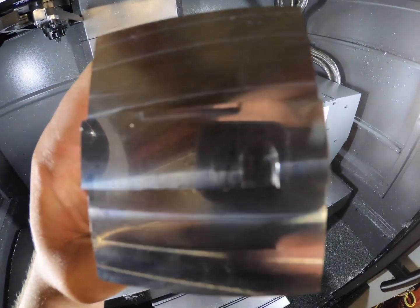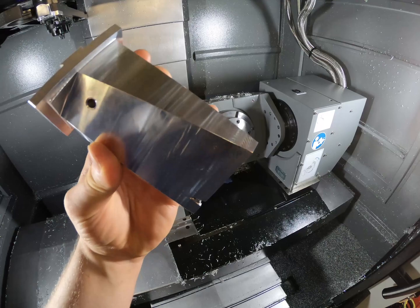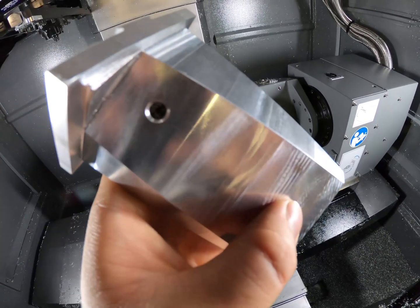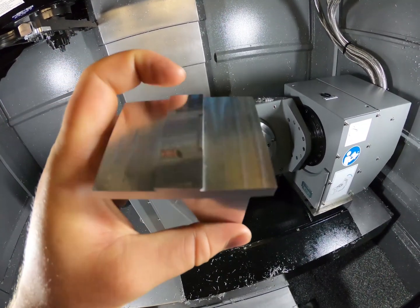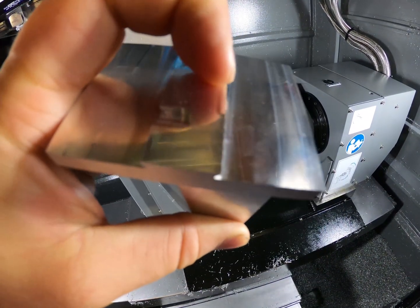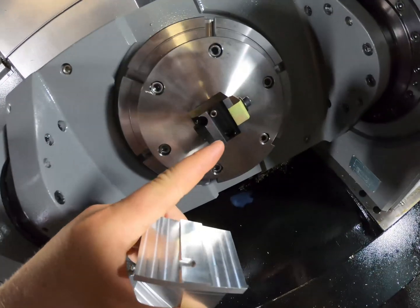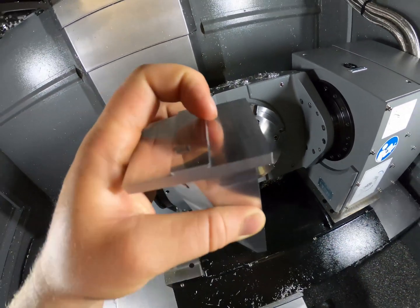The problem we had was we had to torque it down pretty tight, and this thing says to only go about 90 inch-pounds — we probably did 90 foot-pounds, which is way too much. We were getting a little chatter and starting to lose rigidity, so we tried to tighten it more. What was actually happening is the dovetail was deforming a little, which is fine — the dovetail is only the clamping feature. The part is actually held down on this face here; as the dovetail squeezes, it sucks down. It's a really cool design.